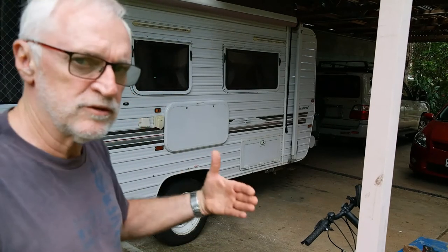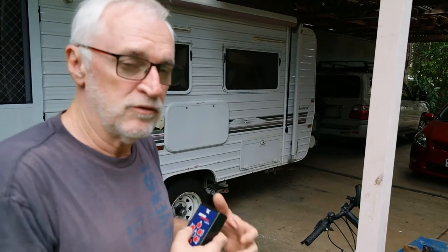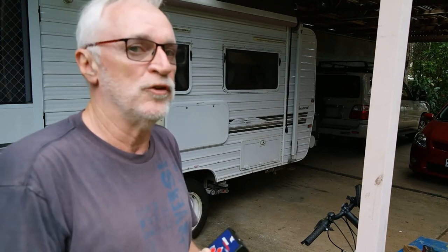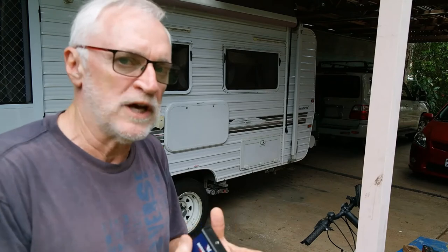I may need to adjust it closer, but I've always put it down to the fact that the grit wasn't working properly on the rollers. Well, I've done that now. The grit is a really nice, aggressive finish, so it certainly engages. There's no reason for the grit to be slipping on the tyres. If it slips now, it's just a case of me getting the rollers probably 5mm closer so that it pushes harder on the tyres.